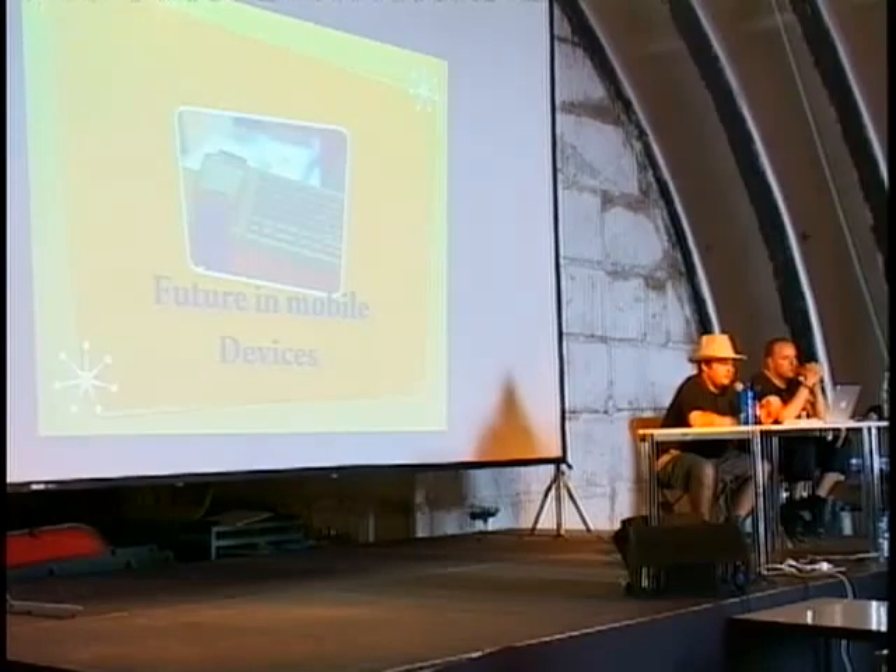People are moving more and more of their life to mobile devices. There will be extremely thin and light devices that can basically do all your work. And the companies that are doing the memory modules are preparing for that. One thing that is apparently coming up is a mode in the flash module that also holds the RAM in a mobile device — that suspends automatically in hardware, without the operating system doing anything — the whole contents of the RAM into the flash. So it's just one pin that says sleep and the RAM is written to the flash and powered off. And if you power on, the process is reversed, happening inside the chip. And that includes kernel memory — that includes all of the memory. So basically all your memory is being dumped on hibernate onto a flash system where you have no real way of erasing stuff in there.